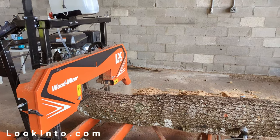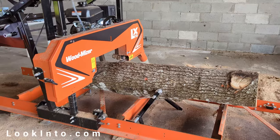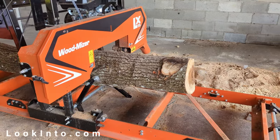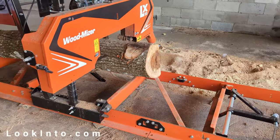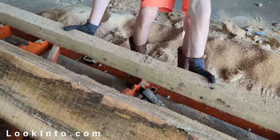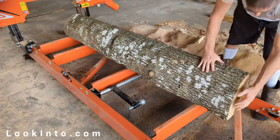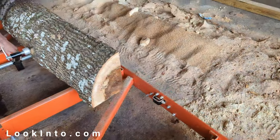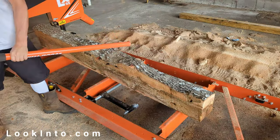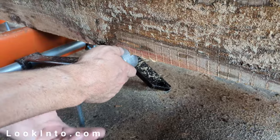This thing cuts like a hot knife through butter. Now we loosen the clamp so we can rotate again. At this point the 4x4 is no longer needed now that we have a 90-degree corner. Muscle it around and finish the second 90-degree rotation. Push or pull the log into the short built-in stops, then secure it down and cut. At this point the height here will become our width later, so get that where you want it — let's say 6 inches — and then do the final 90-degree rotation. Use the notch side of the clamp to hold the log as low as possible so the last board can be as thin as 2 inches or slightly under without the blade hitting the clamps.